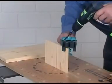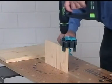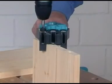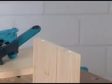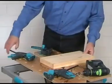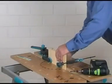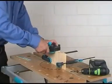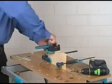Also, edge-to-edge connections can be made quickly and extremely precisely with the new Dowel Master. But also here, likewise to corner and T-butt connections, at first a board has to be fit frontally with dowels. Following, the 2 boards are fixed with clamps and are clamped together in the workbench. Afterwards, please put the Dowel Master with the 8 mm drilling bush on the dowel. Then move the stop firmly against the board side and fix it again with a fixing bolt.